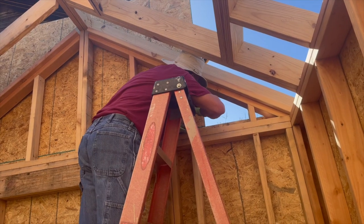We put the sheathing straight across all the windows, everything except for the door, so we still needed one way to get inside. Something smart that Doug suggested was we put up the plywood or OSB against where we wanted to put it, and then Doug would trace out where the door frame was, so he knew where to cut it and we'd be fine. That was super nifty.